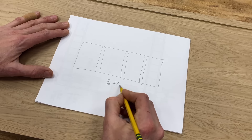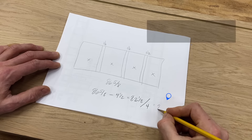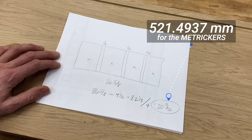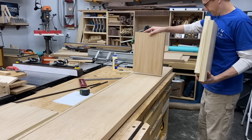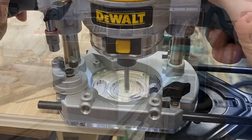Next I needed to figure out the location of my dividers so they were evenly spaced. I took an overall measurement, subtracted the width of the dividers, and came up with 20 and 17/32 inches — or 521.4937 millimeters. And there you go: three big plywood Domino mortises.